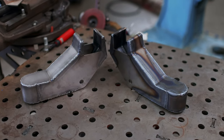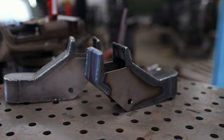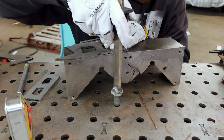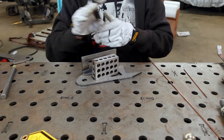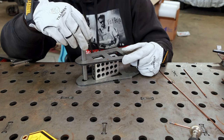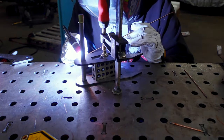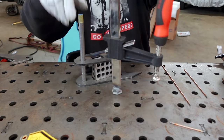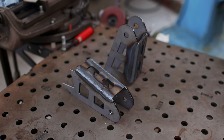After a couple hours of work, we've got two finished front lower control arm mounts, and I'm pretty happy with how they turned out. It's really cool to see CAD-designed parts turned into something as real and as complex as this on my workbench. Next, we've got our upper coilover mounts — these measure 3/16ths in thickness. I initially planned on bending them over and welding the insides, but since I'm TIG-ing them, I decided to clean up any kerfing by splitting them apart and building them in multiple pieces. For all of these parts, I'm using a half-inch steel dowel between the mounting holes to make sure they remain in alignment — as long as the dowel can freely move in and out of the part, I know I'm good when it's time to put a bolt through them later.